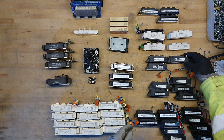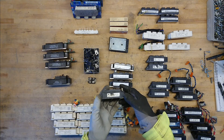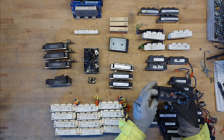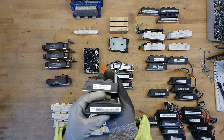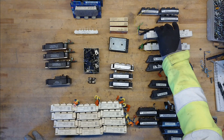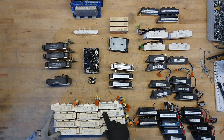The next step up in brick size comes from 100 amp and up. You will see these slightly larger modules, a little more width on them. These are half-bridge bricks rated for 150 amps at 1200 volt DC. The same package type is used for single-die or double-die switches — these are 600 volt DC modules but 200 amps. It's a pretty standard IGBT brick to find in UPS systems and some welders, whereas the smaller ones come from smaller systems, mostly variable frequency drives. The bigger ones come from the large X-ray generators I have taken apart, and some from large UPS systems as well.